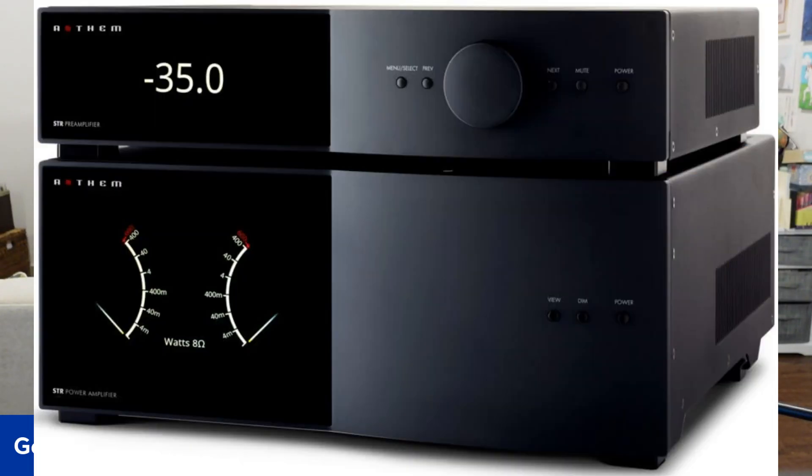I've got experience in the past with ArcGenesis on the STR separates. I still use the STR separates in my two-channel music room — it's in this rack, powering the Revel F328BE speakers. I use Arc and limit the correction to about 500 hertz. My goal is just to flatten and elevate the bass response since these speakers are a little bass shy. But the ArcGenesis in the STR is an older version, so it doesn't yet have all the sophisticated features supported on the new MRX receivers. I wanted to really see what ArcGenesis is capable of on their latest platform.